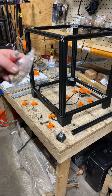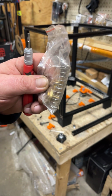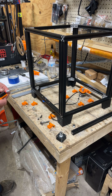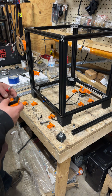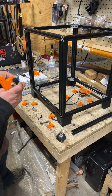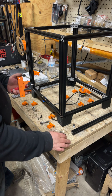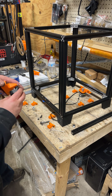So this one is basically 3 pieces. You get a spring, you get your nut, and then a piece there. It's an anti-backlash lead nut. If you put it in upside down, so that the spring is on the upside, it'll just give a little bit of friction. Not enough to really notice it turning the rod, but it's enough so that it'll stop that from dropping. And if you have noisy leads, it doesn't matter which way this turns, because it's going to go in there like that, but remember the belt.